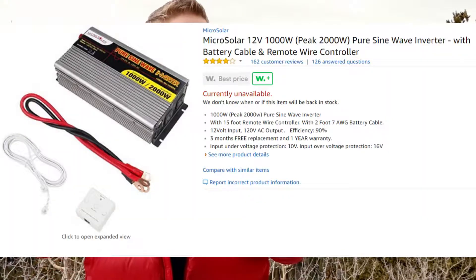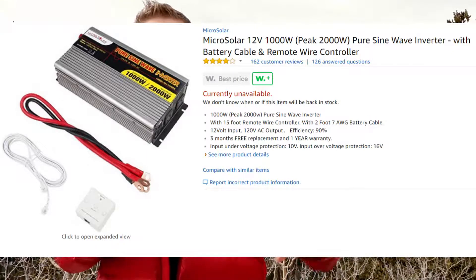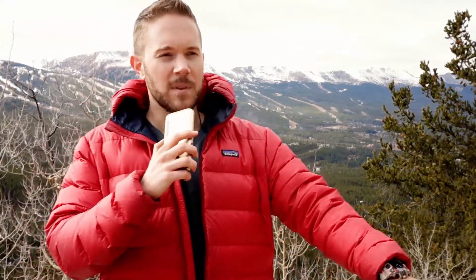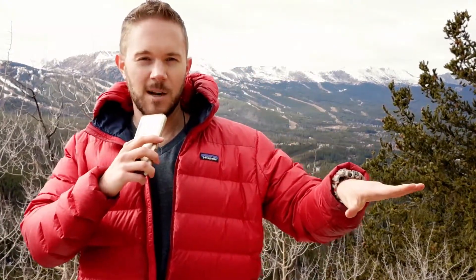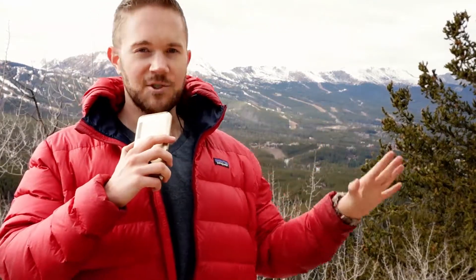Here on Amazon you can see the one I use. It's not available right now, but it was like $120–$130 when I got it. It's a 1,000-watt rating with a 2,000-watt peak rating. What that means is the equipment is designed to handle up to 1,000 watts of continuous power flowing through it, or a peak of 2,000. The peak happens when you turn on something or there's a quick surge — like with my high-powered blender, when I start it there'll be a peak surge of energy that gets that motor running, and then it runs at a steady level. I'd recommend getting one with at least 1,000 watts continuous and 2,000 peak, but you can get some with much more. Definitely get that if you're running TVs, blenders, hair dryers, or anything that generates heat.